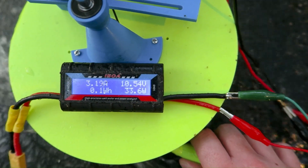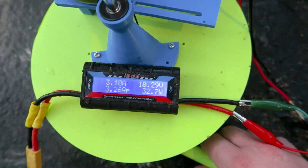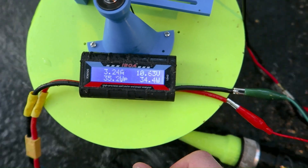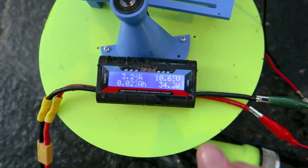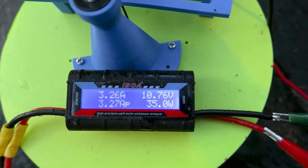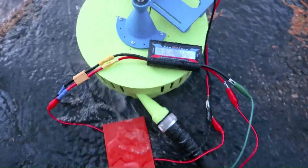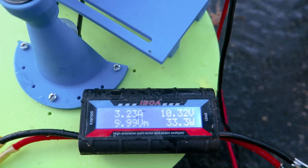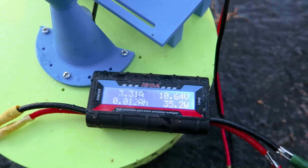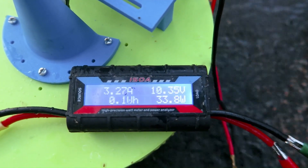There are a couple things to be done. This is only at 10 volts, so if I can get more RPM out of that motor, I think I'll be able to get a little bit more power. I will have to reprint the new stand because it's not wide enough to incorporate a bigger pulley — say a 40 or 42 tooth. A few more tests to do, but it's really averaging at that 35-watt number. I'm going to start working on a couple other projects and revisit this in free time — it's now a sturdy foundation and easy to build off of. Thank you, like, subscribe, and comment — I'll see you soon.